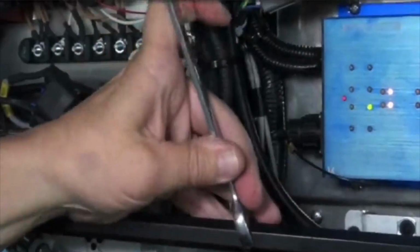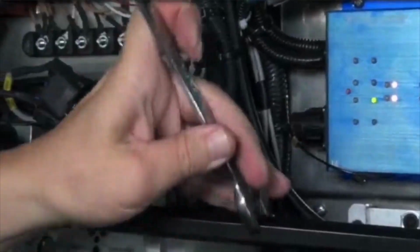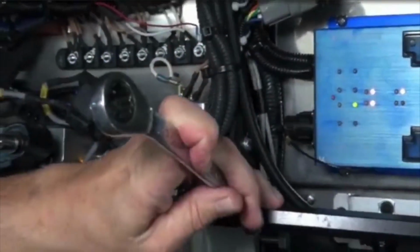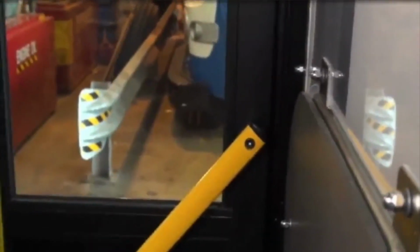Never turn the connecting rod more than 2 turns. Usually, 1 turn is sufficient to apply a proper preload. Check the quality of the seal by pulling on the trailing edge of the door. The seal should be strong and tight, and the door should not be able to be pulled inboard.